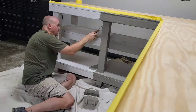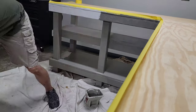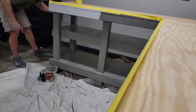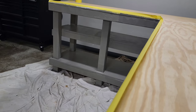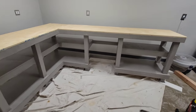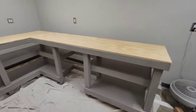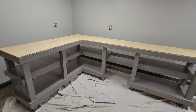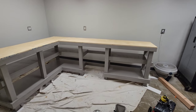I used a little four-inch roller and it made pretty quick work of it. The finish isn't the best — kind of rough — but I was just looking for speed; I wanted this to be dry enough the next day to start stacking all the stuff I had piled up from the other garage. One thing I learned: make sure you do the bottom first and don't paint near your head — I must have had four or five stripes of paint across my face reaching into the very back. I'll come back tomorrow and put poly on the top, maybe a couple coats, just to seal it and protect from stains and oils.